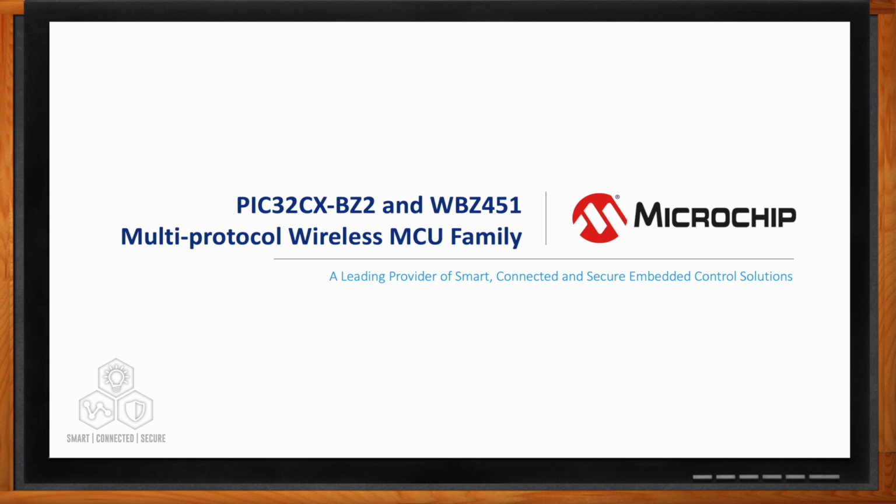Sure. And before we jump into the applications, let me give you a very quick rundown on why you would want either Bluetooth or Zigbee or both at the same time. If you look around yourself, you'll see Bluetooth is present in every single device that you have, TVs or laptops or smartphones. So the applications for Bluetooth, especially in the consumer market space, are limitless. And on the other side, Zigbee is a popular mesh network protocol, meaning if you want a lot of devices to be talking to each other over a larger distance, like in a warehouse or in a factory, then you would need Zigbee.